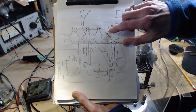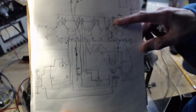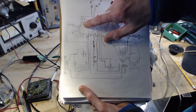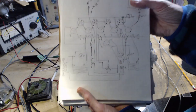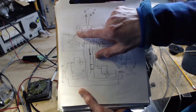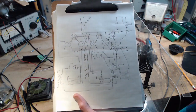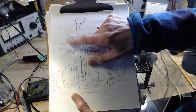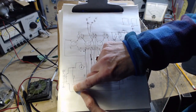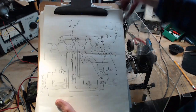They also discovered a difference between these three IF transformers, or as they're called here, ultraformers. These ultraformers, and this one is slightly different. I measured a different primary resistance here. Sure enough, it's a little bit different. The main difference is the two coils in these are closely coupled. The two coils inside here are loosely coupled. They're separated by some distance. Someone opened up these things and looked inside, and discovered that they were more loosely coupled. Transformer here, hooked up essentially to this transformer, and this one, and then electromagnetically this one, and the whole thing's hooked up here.